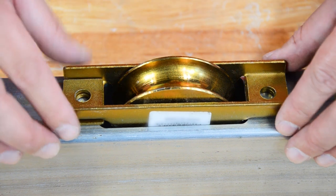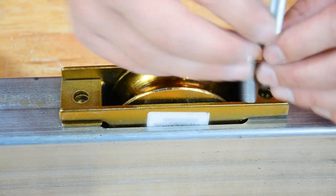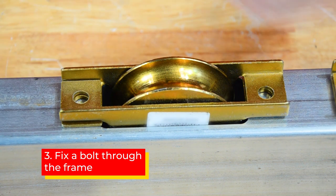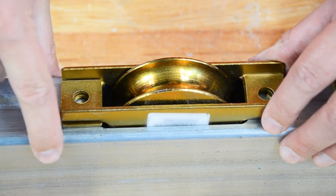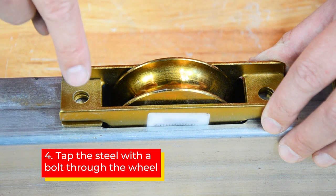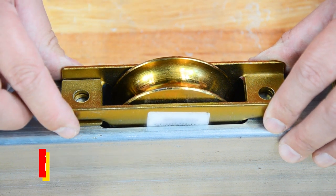With the final one, I've still got my track wheel loose. We could use a bolt all the way through the frame, or if your gate frame steel is thick enough, you can tap the steel and put a bolt straight through the track wheel, fixing into the gate frame.